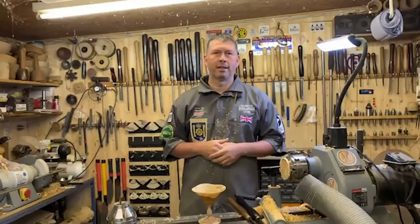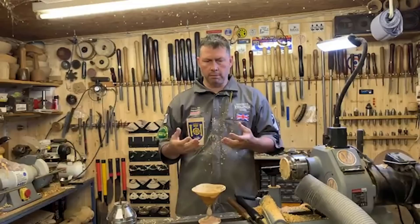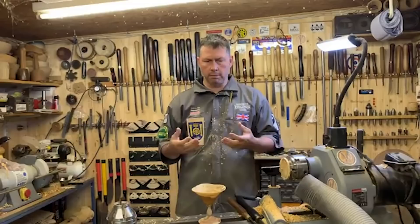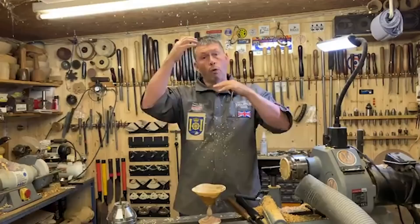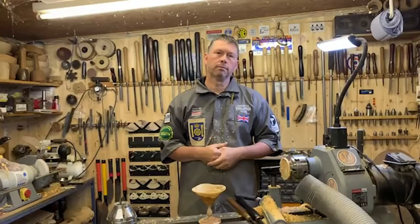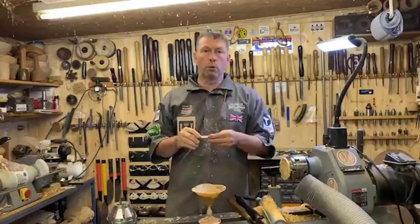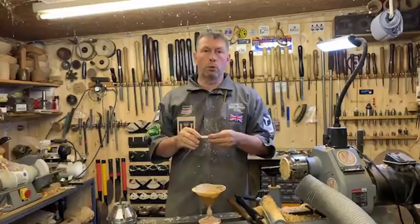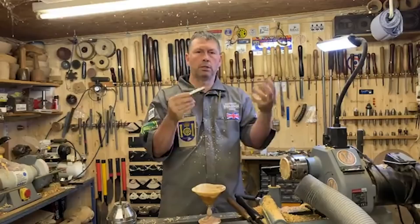Sean's just saying: does bowl turning tend to generate more dust than spindle turning? It does - absolutely. Spindle turning you'll get some dust, but the amount of surface area contact on a bowl means you're always going to get a lot more dust. Whatever you're doing, even if you're not sanding that day, always protect your lungs - a dust mask or full face visor would be better. John is just starting out and wondering how do you secure a drive centre to the headstock, or is it just the pressure of the wood from the tailstock? All drive centres and tailstock centres are on a Morse taper - around about one degree, so it's a very fine taper. The pressure against it from the timber locks it into the headstock - you don't need to knock them in or screw them in at all.